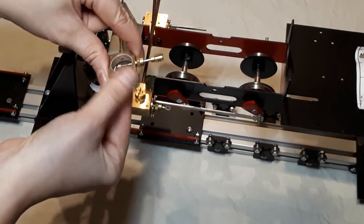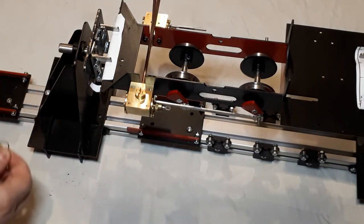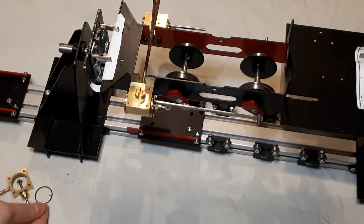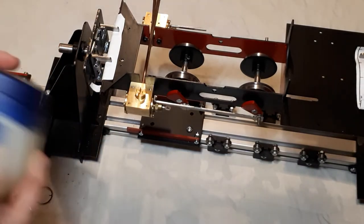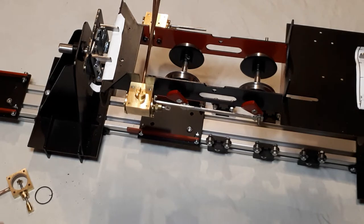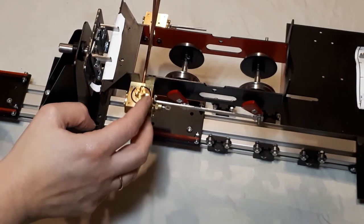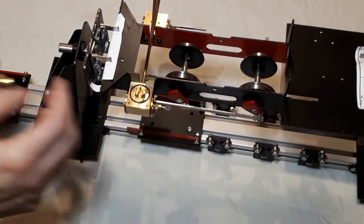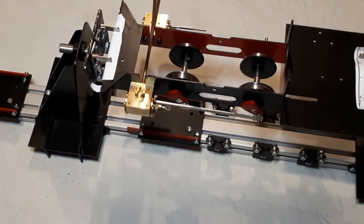It's saying that's difficult because as soon as you let go, the ring would fall out. Now, a trick to get around this is just to use a little bit of Vaseline to tack it in place. This is Vaseline I use for my sign writing to keep my sign writing brushes clean. So that is how I'm going to do it, slightly differently to the instructions, just because I think putting that O-ring on the top of there and then faffing about to try and get it to sit as an O and not pinch it as I put that on there is going to be quite difficult.